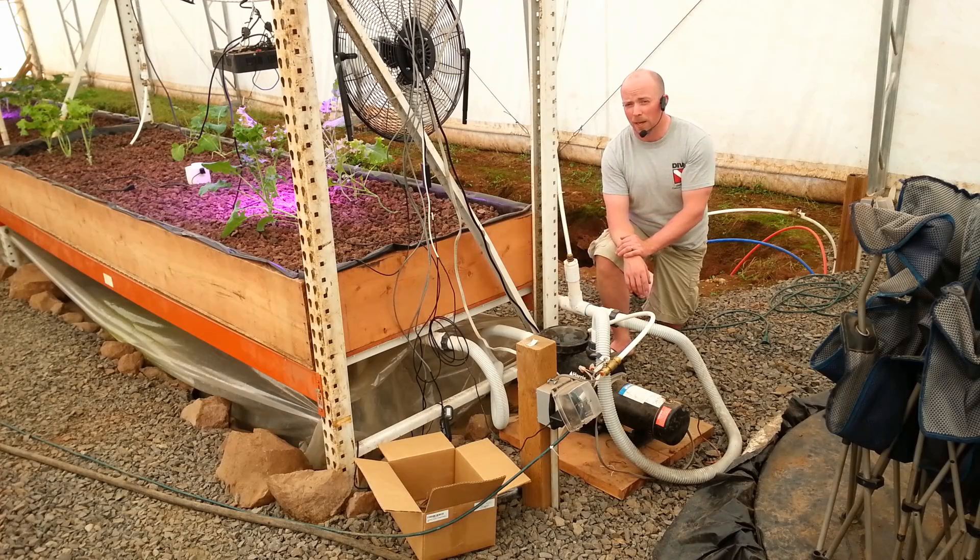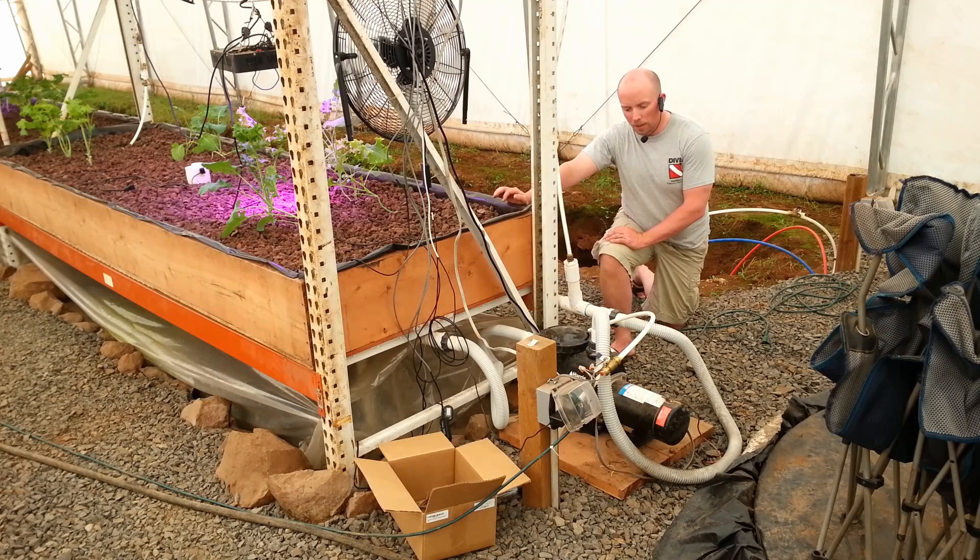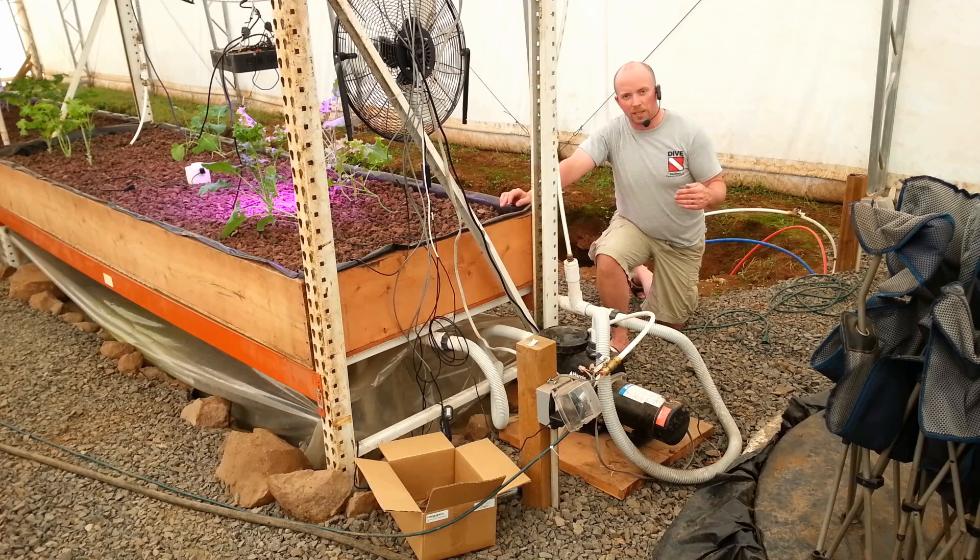Multiply that out across four lanes and you get roughly 80 feet of total head needed to move everything through a central pump — or just for the aquaponics portion. If we go with geothermal heating, we'd need to pump water from each of the fish tanks out through the geothermal system and then back into the grow beds and watering system. A central pump would probably be best for that, but the hard part is we need to draw equally from all four lanes at the exact same time, and I'm not sure a manifold would work.